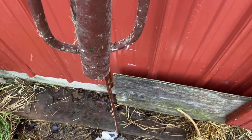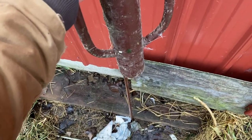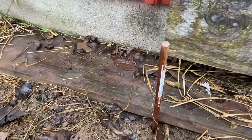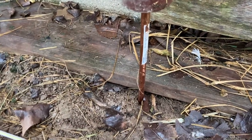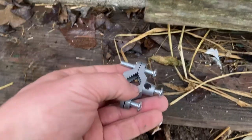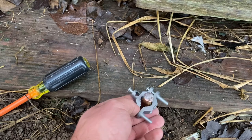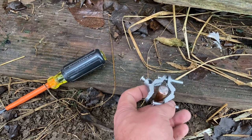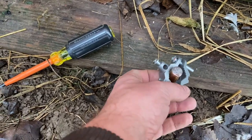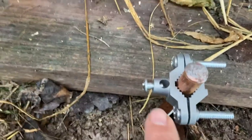Putting in this grounding rod on a wet day with this post driver makes easy work. Once I got the grounding rod down so far I used the closed end to drive it down further, then I'll be able to hook up the wire. This is the ground rod connector - I'm orienting it this way. One part of it can come off and I'll use a Phillips screwdriver to tighten it down. I have it snugged down.